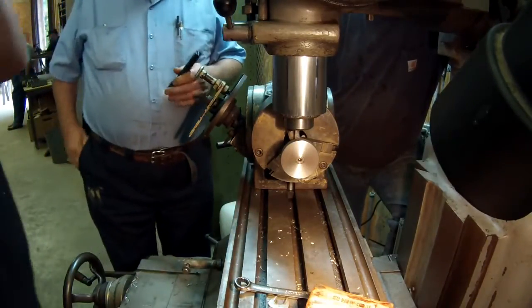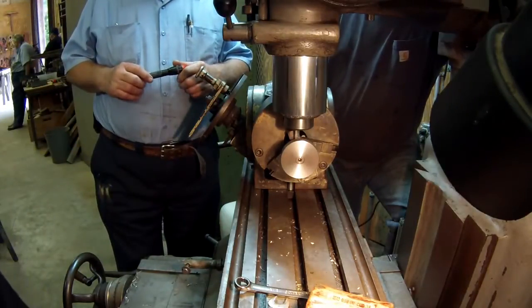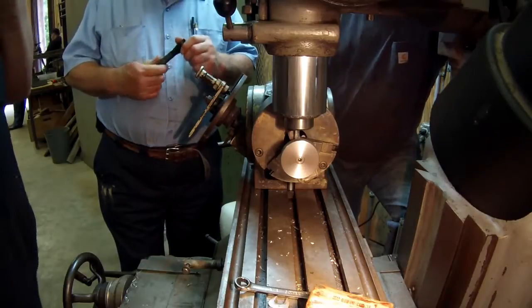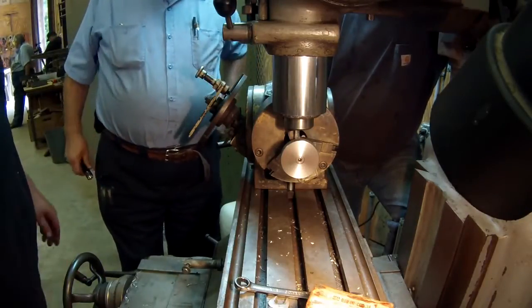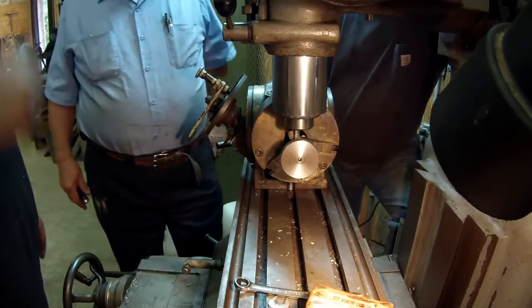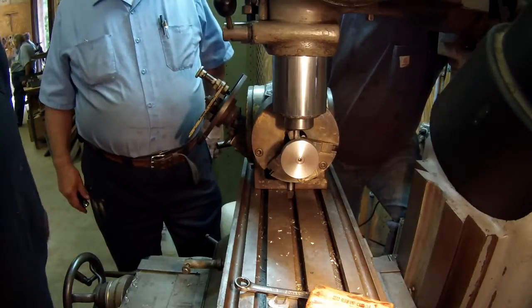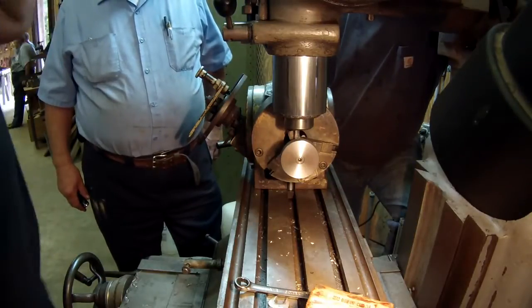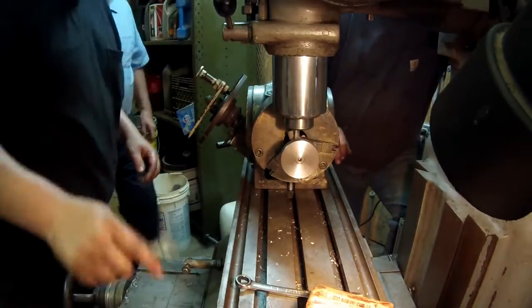Now what we got to do is every 5 lines is going to be all the way across. It says so the ones in between is going to be a halfway. So my next one, I'm going to have to go halfway and hit a 0 on X up here. Alright, so let me index this thing around one time.